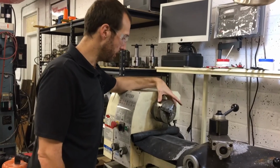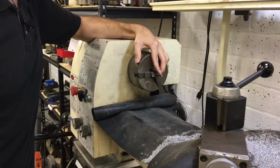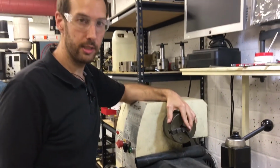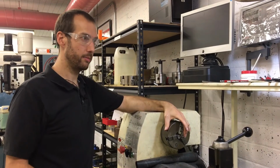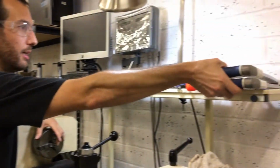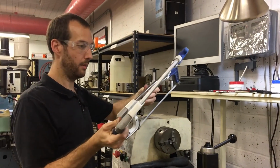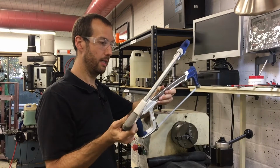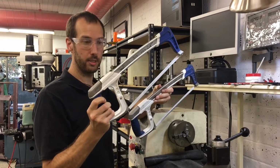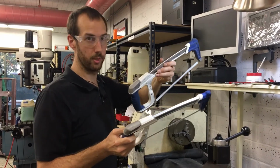Okay, so another option for round stock, I like to do this for particularly nasty materials, usually smaller diameters that aren't too big. Could be a stainless or a hardened material or something like that. I do keep 2 hacksaws set up. It's a quick, easy, manual way of cutting off stock in the lathe. I have a fine tooth for steel and harder stuff, and a larger tooth for aluminum.